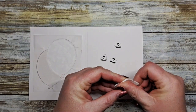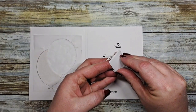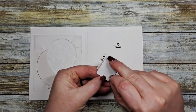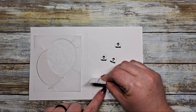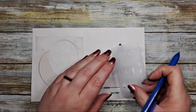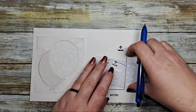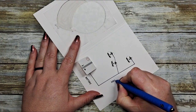We're going to fold up our battery holder, peel off the sticky backer, and adhere it down to that battery location which we've already traced. I want my negative to come out the right hand side and my positive to come out the top, so that's why I have flipped it up. We're going to locate all of our negative sides of our circuit — I'm doing that with a blue pen today — and just quickly label that.